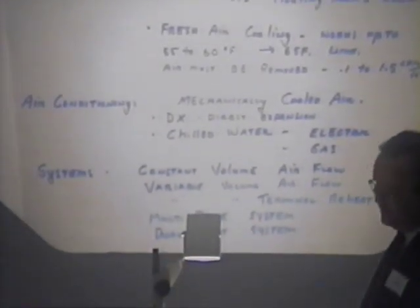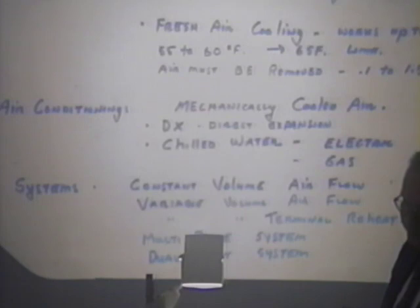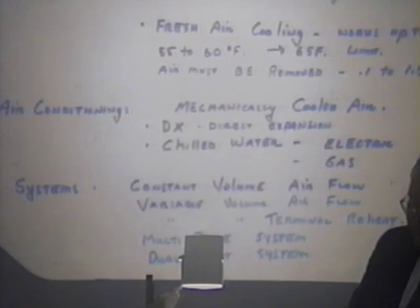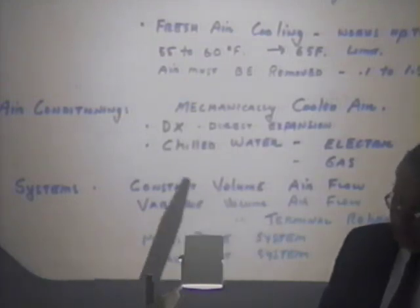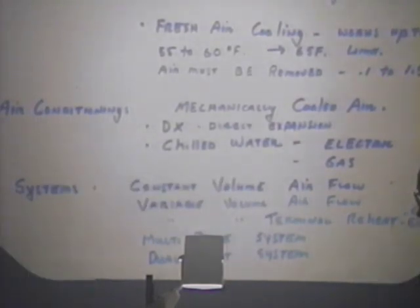Air conditioning, when we're talking about air conditioning, we're normally talking about mechanically cooled air. And those are categorized primarily as DX, direct expansion systems, and chilled water systems. We're treating the air with either refrigerant in a coil or chilled water in a coil. Most cases in Oklahoma, if you have chilled water, you're developing that with an electric system of some sort. Usually it would be in a large building, a centrifugal system. In a few cases, which I'm aware of,